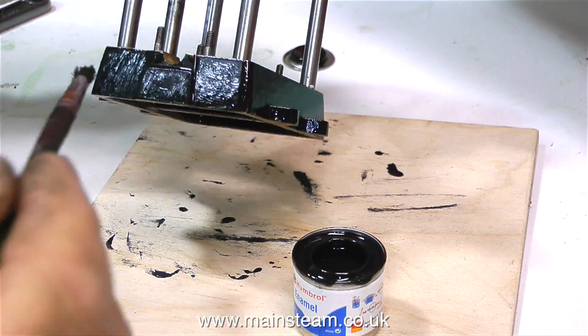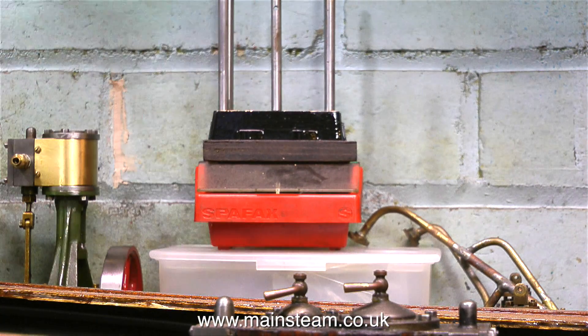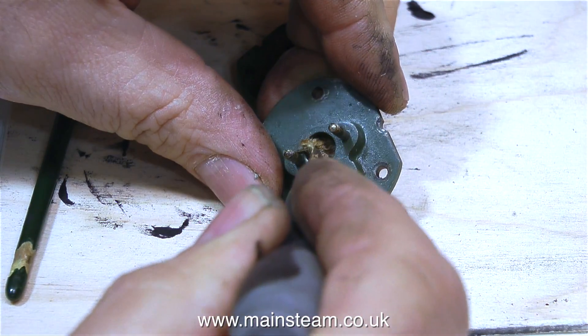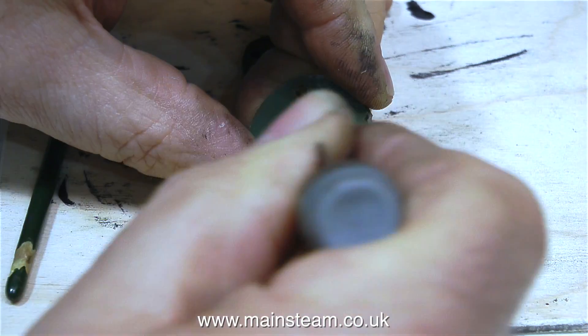The best place for this is on its original mounting base, which is on top of the red box containing the parts. Now I'm going to work on some other parts for the engine — these are the lower cylinder covers. The first thing to do is to remove what's left of the old graphite yarn, because I'm going to replace it with some new stuff.